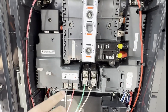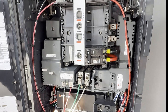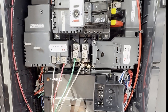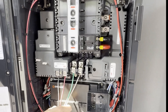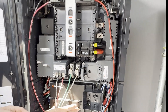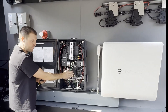Last but not least is the back feed coming out of the actual combiner to your main panel. These lugs support up to a two-aught wire size. With these larger wires, if you need access to your gateway for any reason, it'll be a little tough to actually pull them to the side, and we actually recommend you not doing this. So what we've done on the gateway, we've actually improved it. Production models include two screws which will just fold down, and that'll give you access to your gateway. You can slip it right back underneath and attach it with those two screws without having to pull or remove those actual wires.